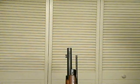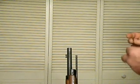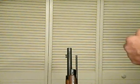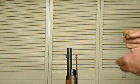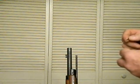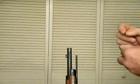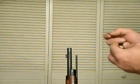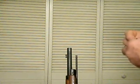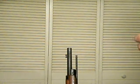I could not find a source for sight posts for Mosin rifles. There are some fixes that involve putting solder on the tip of the post, or a piece of shrink tubing, polyethylene or different types of plastic tubing over it, cutting them off at different lengths, but those really didn't satisfy me. I wanted something that looked original other than the height. So I manufacture sight posts right here in the shop. They are the exact same diameter as the originals. I can make fatter posts or skinnier posts if somebody wants one, but I like to have it look original, other than the height.